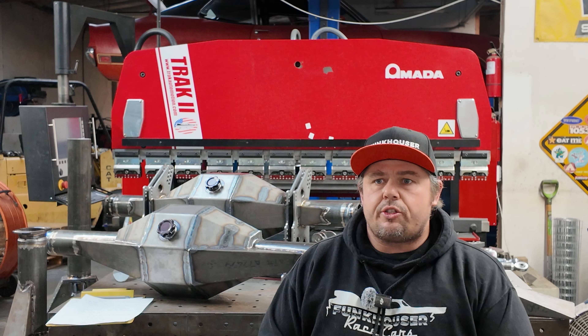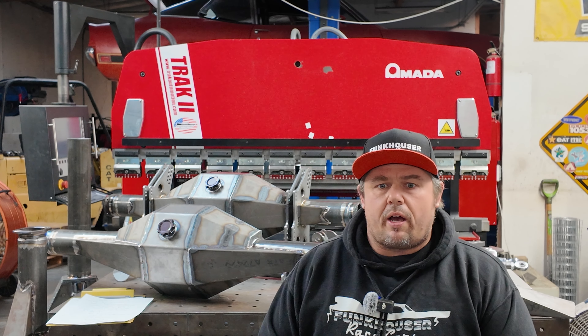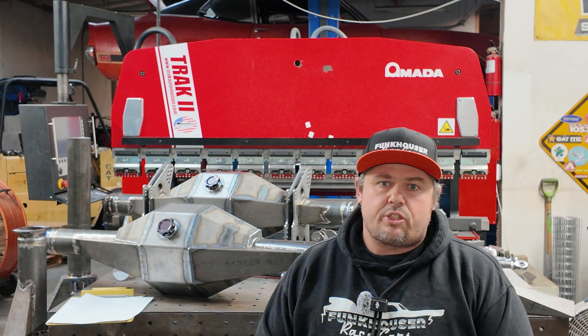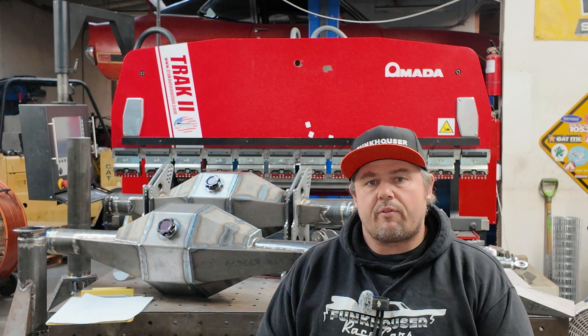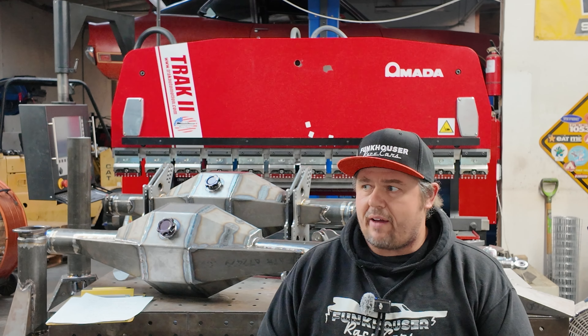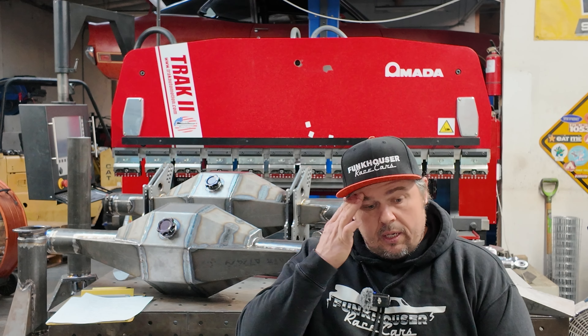All right, what's up YouTube, I'm back. This year we did a total revamp on our fabricated housings. I wanted to be able to offer a product that I could easily retrofit to whatever application I needed, and I wanted to have some standard applications. We're going to have 60-62 to 67 Chevy 2, which we've already covered — you can just buy a housing. I get axles from Quick Performance; my standard stuff is 35-spline axles, 5/8 wheel studs, the drag-style studs.